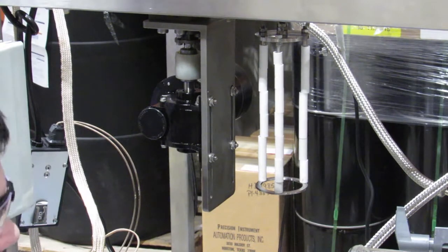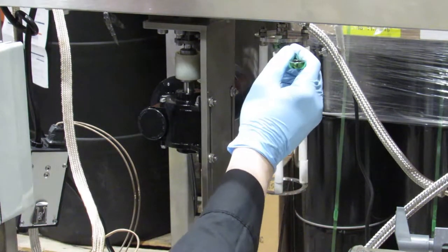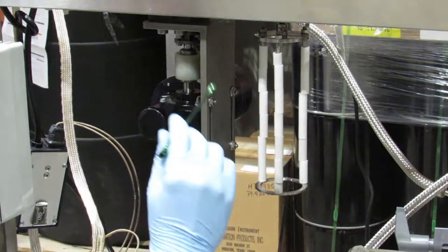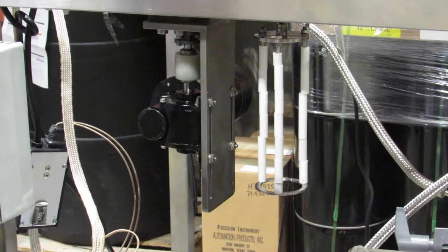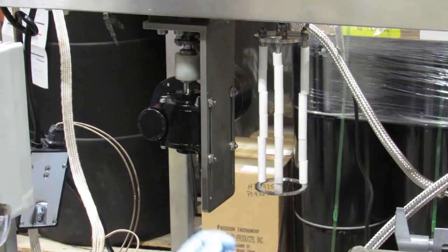Next, we take our 10 millimeter wrench and we tighten and loosen the bottom and top nuts so that the surface gauge can run smoothly along the inner ring of the wiper basket. That will make it true.